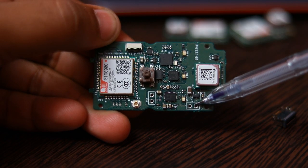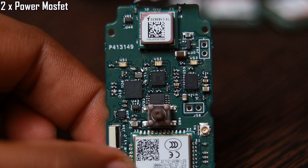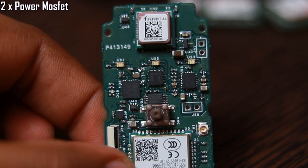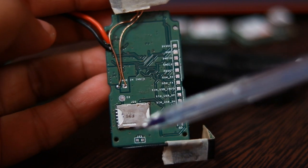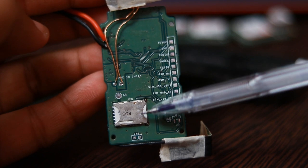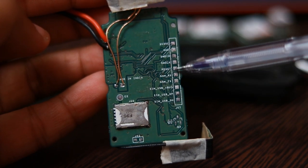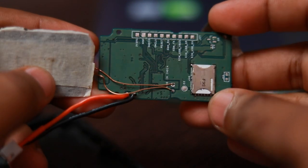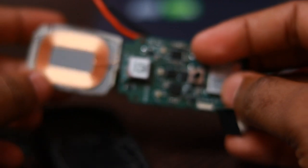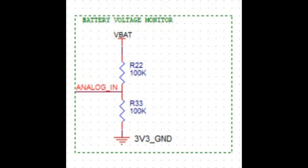Battery connector and charging coil connector are both 2-pin through-hole connectors. Power MOSFETs present in earlier designs are added for controlling the power to the GSM and GPS modules for switching them off to support low power modes. A nano SIM push-pull type connector for SIM card insertion is provided on the bottom part of the PCB so that the user can open the enclosure and easily insert a SIM card from the back side. I also added assembly pads on the design so that they can be used for programming the MCU during production using spring-loaded contacts. Unlike earlier designs, the battery will get directly soldered onto the board with no switch provided for disconnection — the power is totally managed by the MCU. When the battery gets below a certain threshold, the MCU reads it through ADC periodically and takes measures to not turn on the GSM and GPS, staying in ultra-low power mode until the battery is charged.